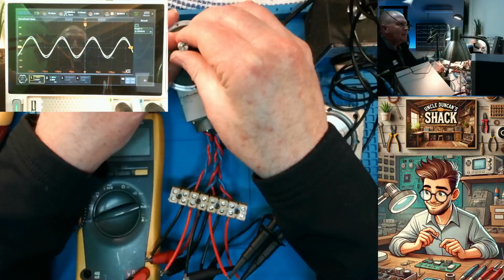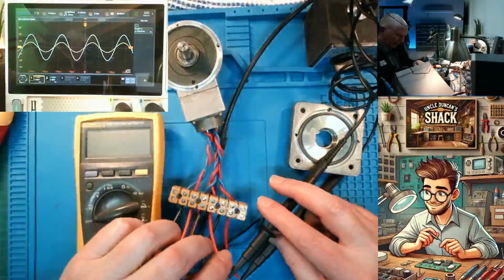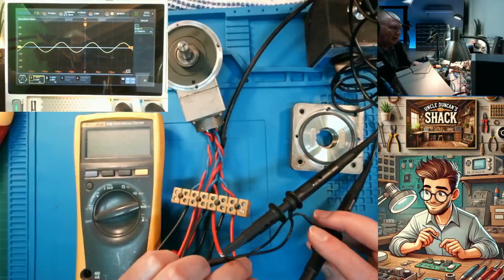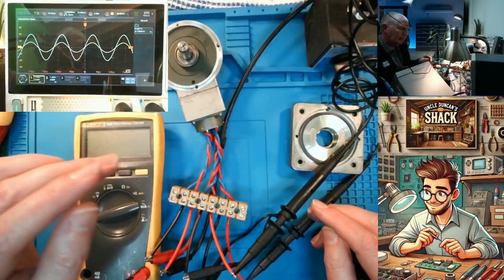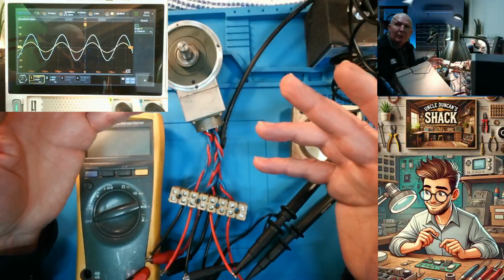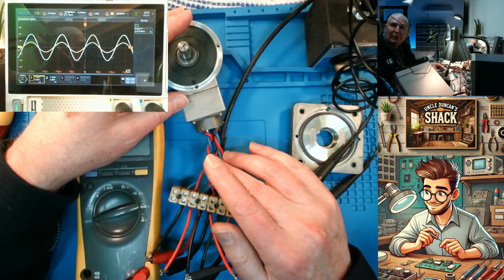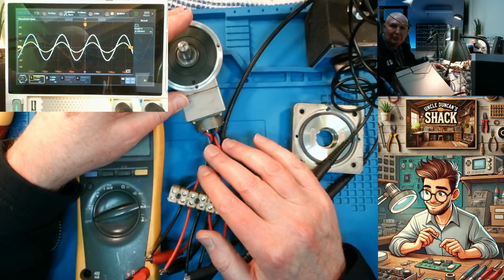And in terms of integrity, you can easily see over here if a wire is broken, because you no longer get anything out from it. Same for the blue. If you get a wire break, the blue goes straight and you know you've got a problem. Also, your controller can check that it's finding the resistance of the winding. So there's a lot of safeguards that you can build in which are very effective. The other thing is that the output signal coming from this is very immune to electrical interference. It's a fairly low impedance circuit, therefore you don't easily get induced voltage into the circuit and interference. Very good.